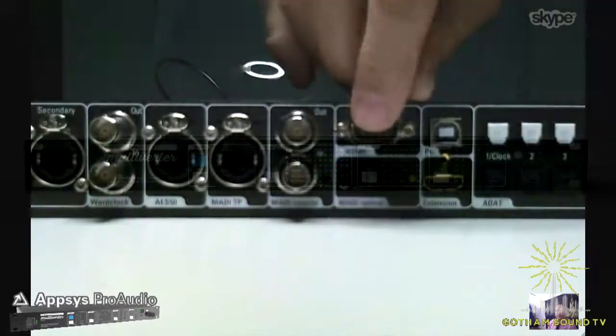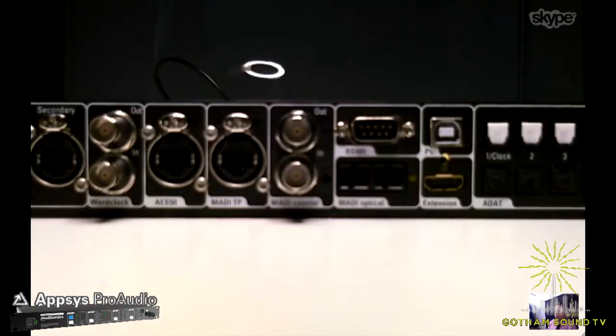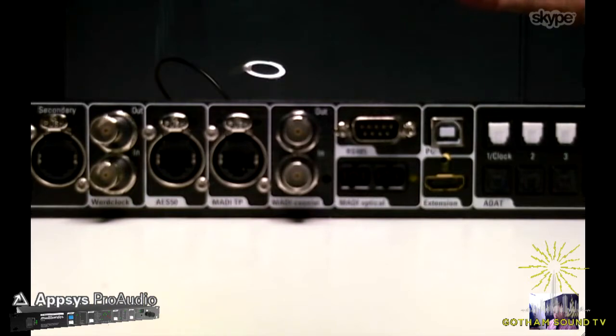You can see here this RS485 is compatible to the Yamaha head-amp remote protocol. So how would that work in practice if I wanted to control, let's say, a Yamaha preamp from my Behringer console? Could I do that? That should be possible. Not in the first version because it's a software functionality, but it is planned, and I have all the information required to do that. Great. A Behringer console and a Yamaha preamp, or even the reverse, a Yamaha console to a Behringer preamp. Both ways are possible. That's great.